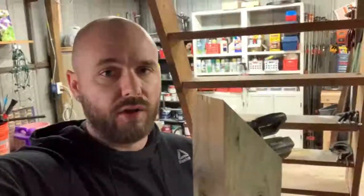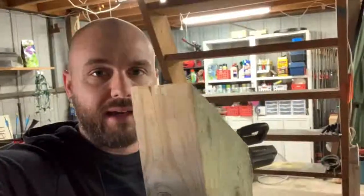A good tip: our miter saw is not large enough to cut through the full four-by-four. You don't have to run out and buy a new tool every time something doesn't work exactly right. I just flipped it over to the other side, turned the saw, and got a really nice clean cut. Make work what you can. It's great to have the best new toy, but sometimes you can't — you've just got to figure it out. You can still make a nice clean cut if you take your time. Just turn the 45 the other direction, flip the board around, and cut through it the other way.